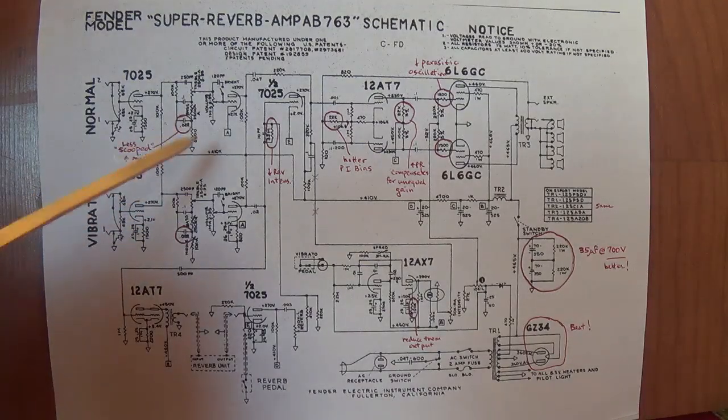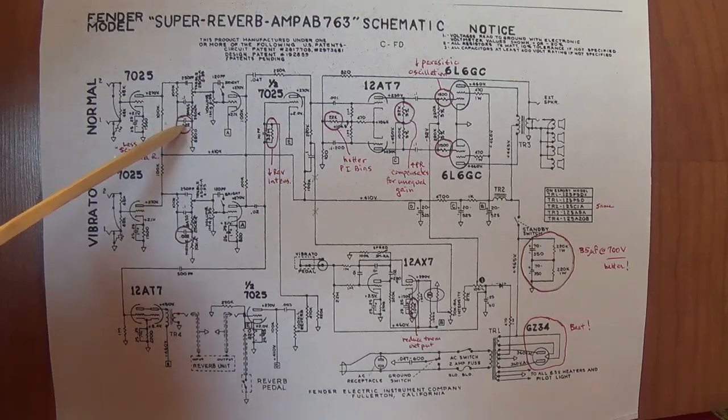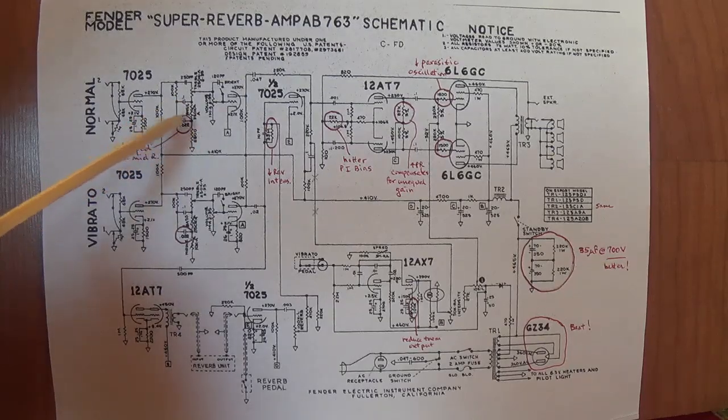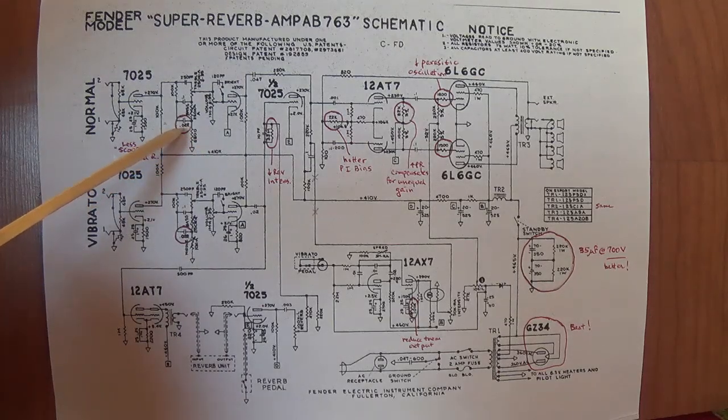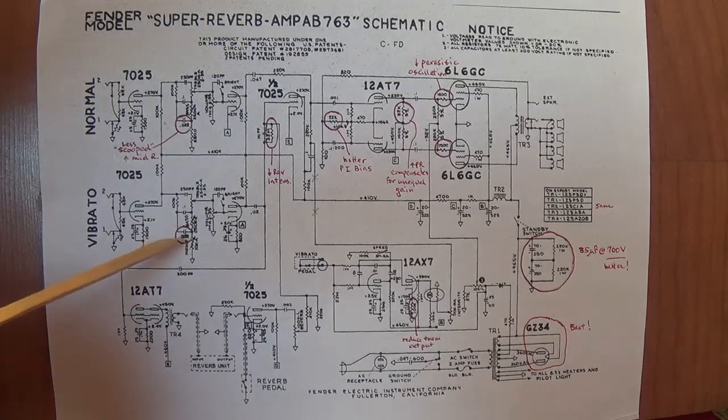They did the same thing. And by putting lower capacitance right here in this position, they allow less of the mid-range to go to ground. Remember that the AA had 0.033 microfarads, so it would tend to let the mid-range go to ground. The 0.022 will tend to preserve more of it. So the end result of this modification is we get less of the scooped Fender tone, okay? And we get an increase in mid-range. Now, if you are a big fan of the scooped tone, you can go back to the 0.033 microfarad cap